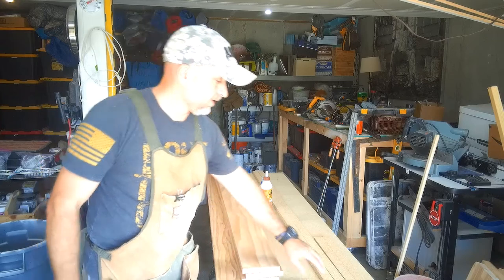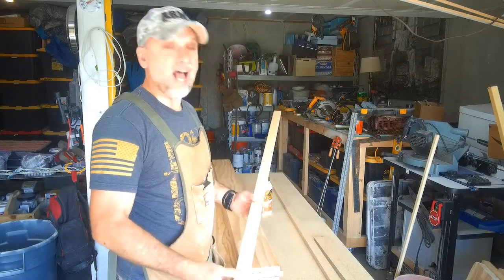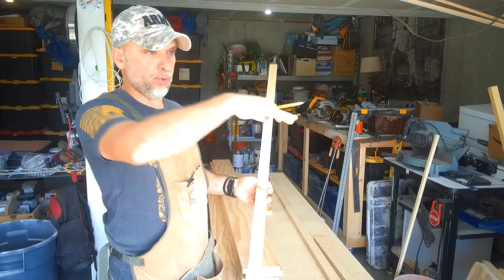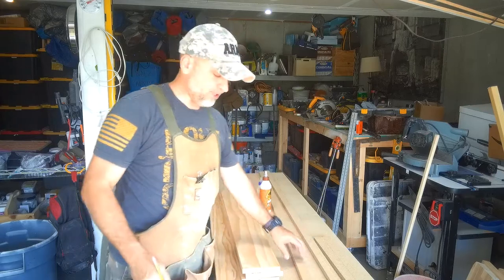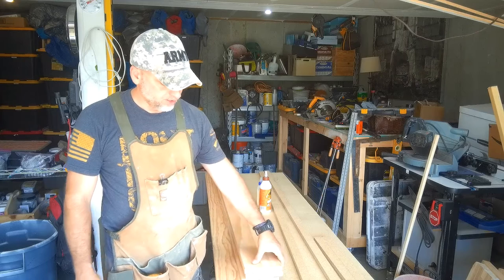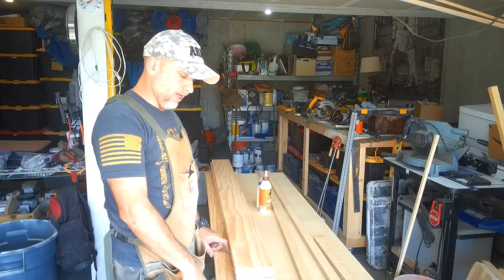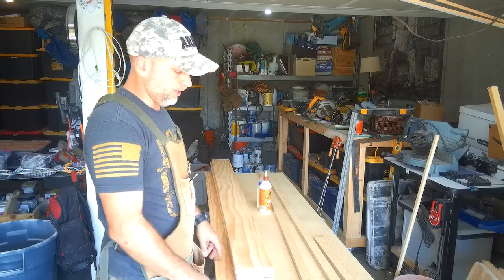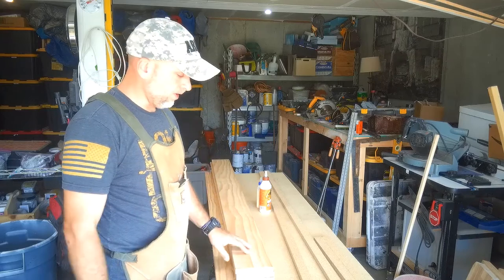inches wide. We got these ripped out of the other side of that same sheet of particle board. They're 1.5 inches wide. There'll be support that go around the perimeter of the bottom of the countertop. And we have select pine 1x6 material. We got four of those, and then a 1x3 of the same select pine in a 6 foot. It's going to finish up the end. It'll be back towards the wall.